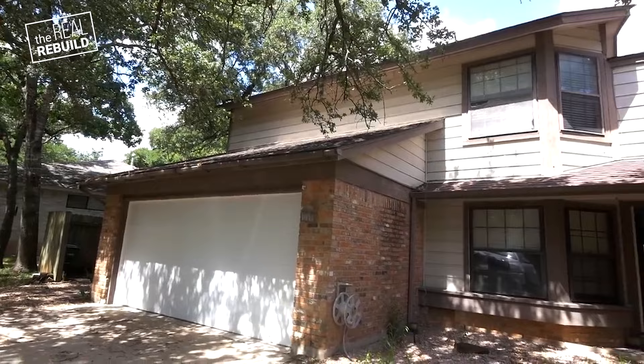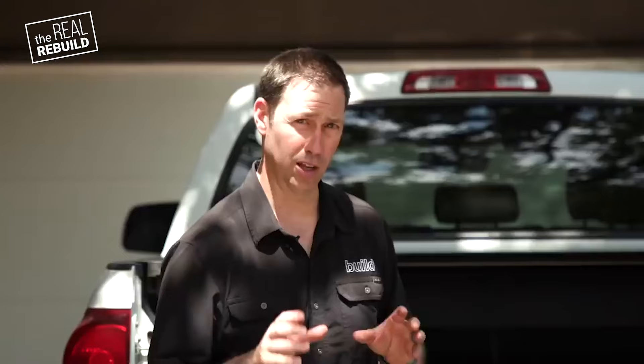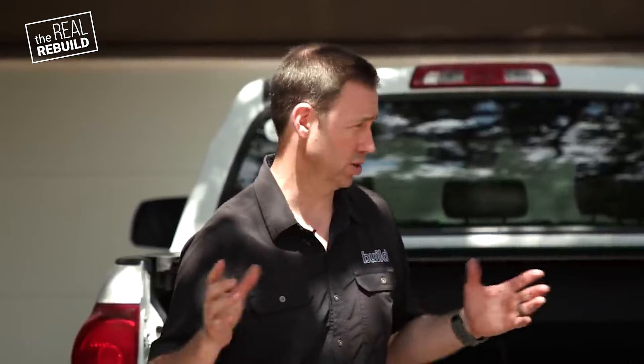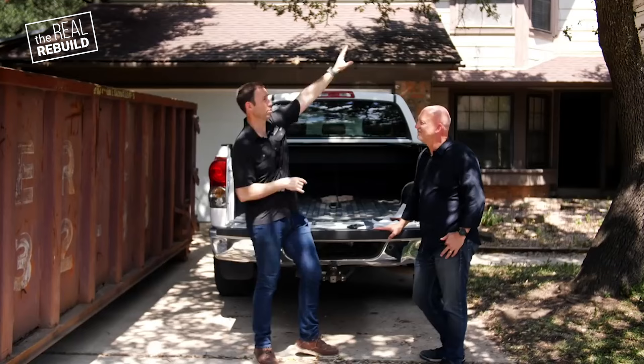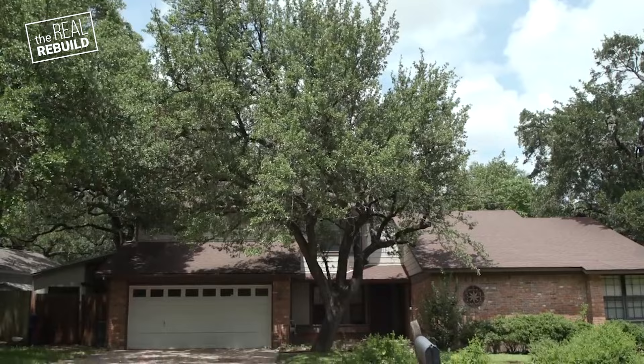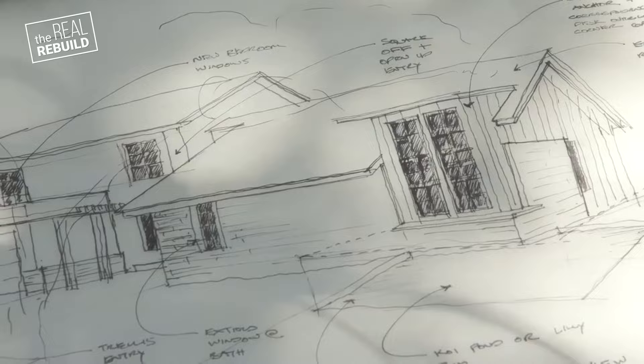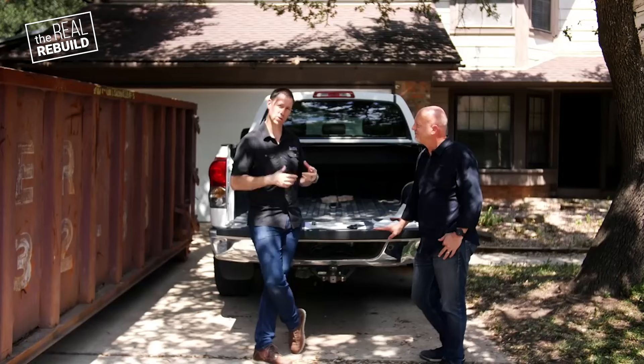After Kit presented that to me, I thought about it overnight and called him back. I love the direction, but there were a couple of things I wanted to change based on my building experience. I've built a lot of flat roofs on expensive houses and I like them, but flat roofs are typically a 20-year roof requiring maintenance. Plus, we've got a big old oak here, and I didn't want to be climbing up regularly to clean out scuppers and drains. So I said, instead of a flat roof, what if we pitch that somehow? And I felt like this house needed some kind of porch. Also, the master pop-out was a little too modern for me — I wanted to tone that down.